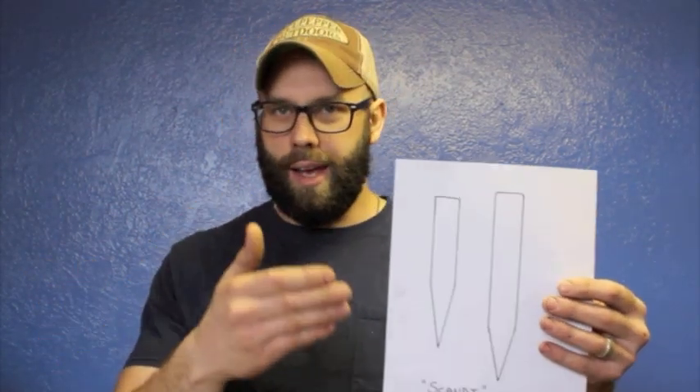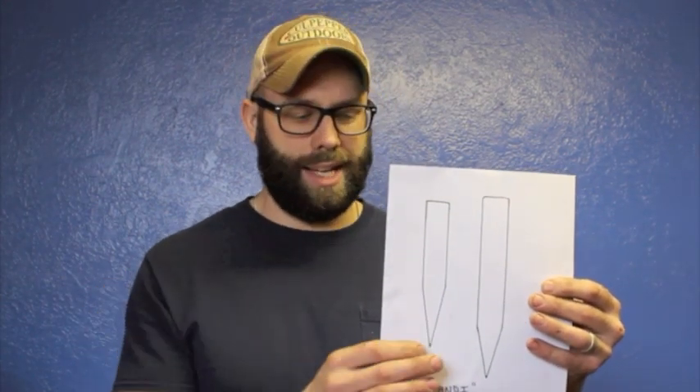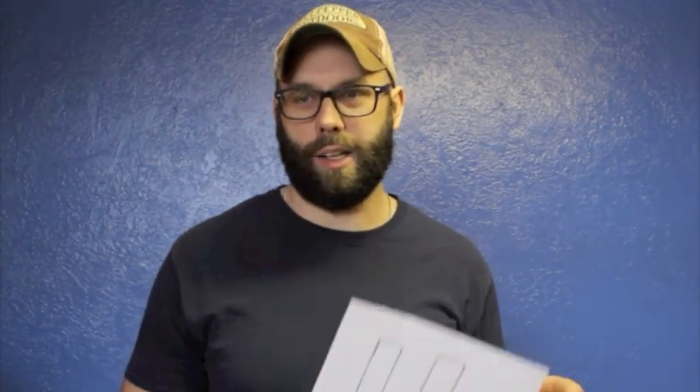The Scandi or Scandinavian grind is prized as a woodworking tool, and it works well as a general-purpose knife. There's very little resistance at the cutting edge because of that zero-ground bevel. You want to pair a Scandi-ground blade with good steel and proper heat treating to help that edge hold up, because one of the inherent drawbacks of a Scandi grind is there's less material right at the edge, making it potentially a little bit weaker. But with proper knife-building technique and use, it makes a very good knife. You can also go with a little bit thinner cross-section of steel, which you generally want to, because you're not taking away all that material like you would with a full flat grind.